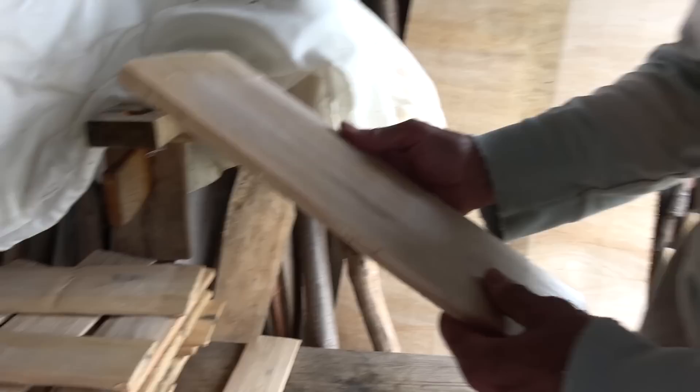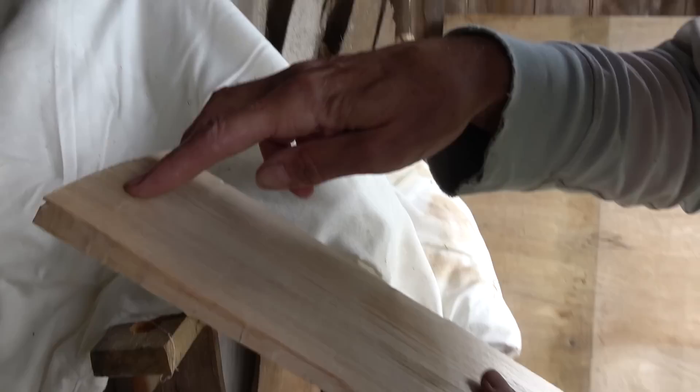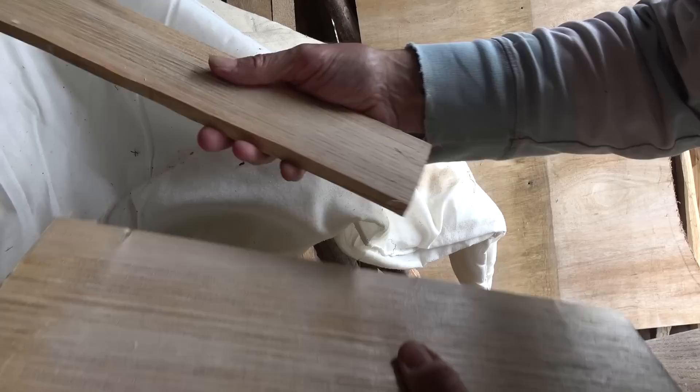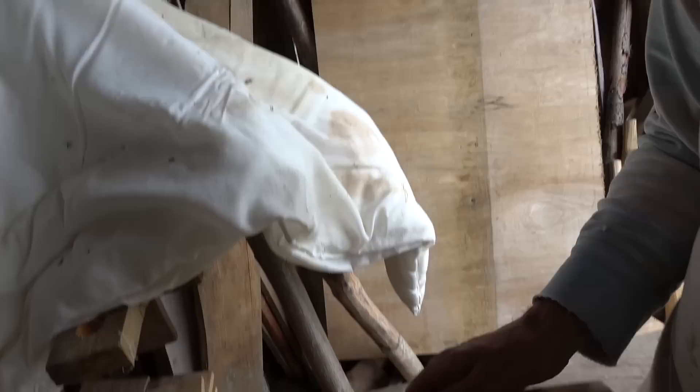A very important thing while we're talking about laying shingles: a lot of people make the mistake of putting the nails through at the top edge. Shingles are quite light — that's the reason they were used on church steeples. If they're nailed just at the top edge, the wind gets under them and it acts like a hinge. What you actually do is nail through at the second batten down, about there, and it's covered with the one above it. The batten above and the batten below mean that the shingle is wedged down and locked in place.